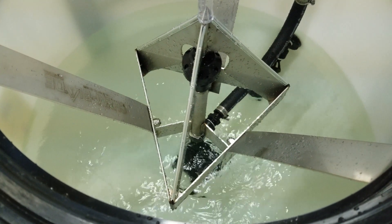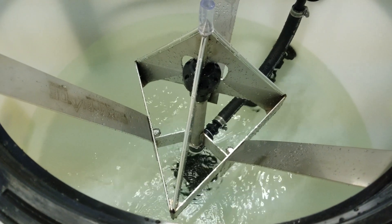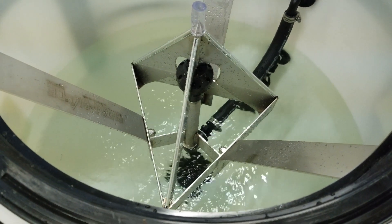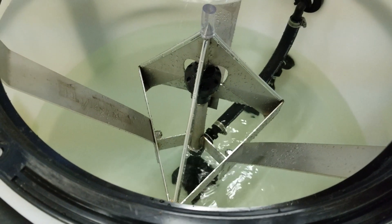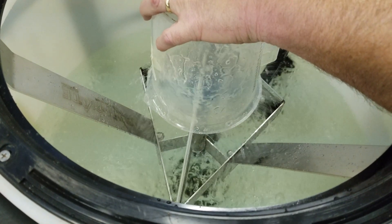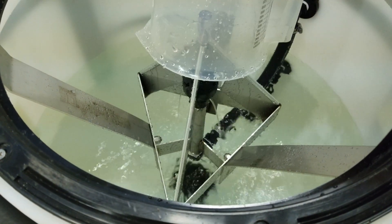If you're doing a dry powder, I do highly recommend that you get the water level up to about this level before you start adding those dry powders, so it has some liquid to help move it around and help dissolve it. That's how the agitation works. I'm going to show you with this measuring cup how the spinner works to rinse those nozzles. You can see you can use that to either rinse the jug, or with the lid in place it will rinse the entire tank.